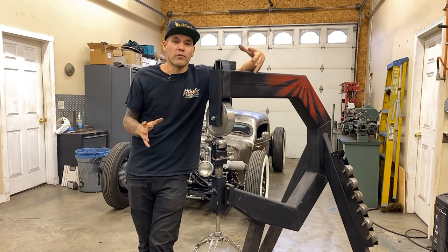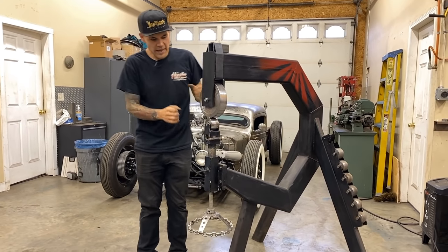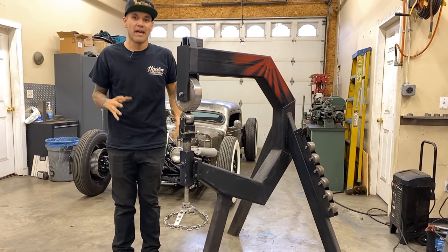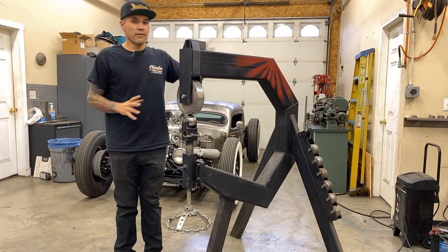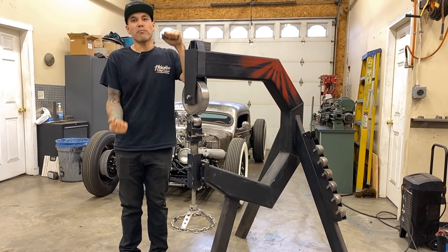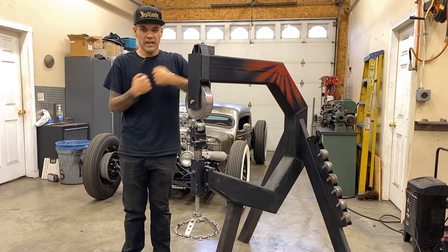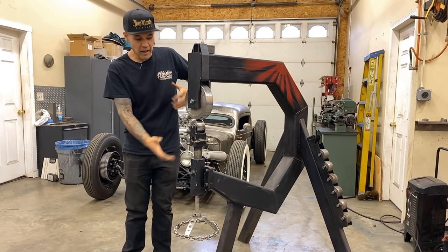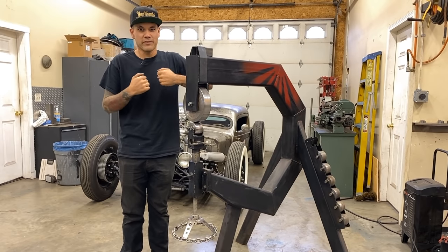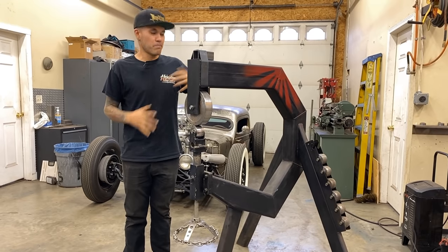We talk about something called deflection. That is when you tighten the wheels together and you start to add pressure and it flexes your frame. If you have a really thin walled frame, not a very large frame, you're gonna have more deflection, and that's where your inconsistencies will come in. Your surface tension, the pressure that you're applying to your panel to stretch it, you're not gonna get consistency, because you're actually stretching out your frame. So the more you tighten it, you're not really pressing, you're just bending your frame.